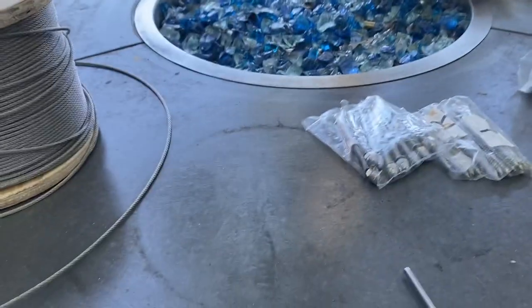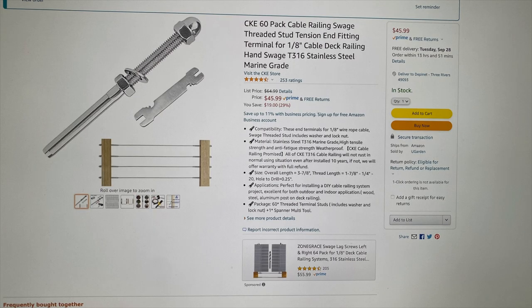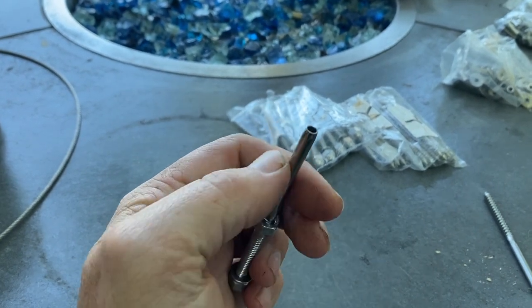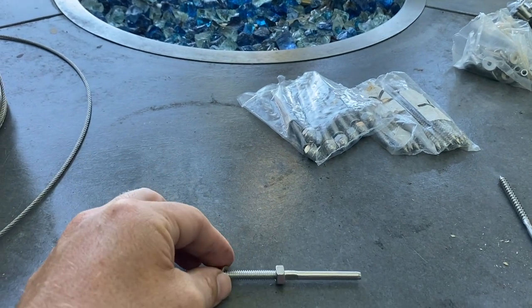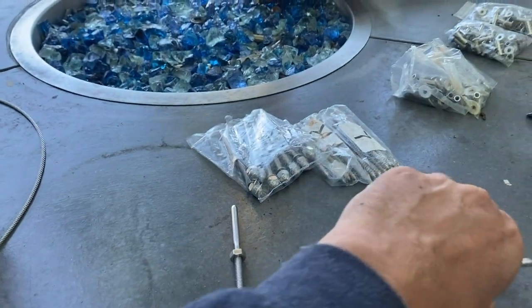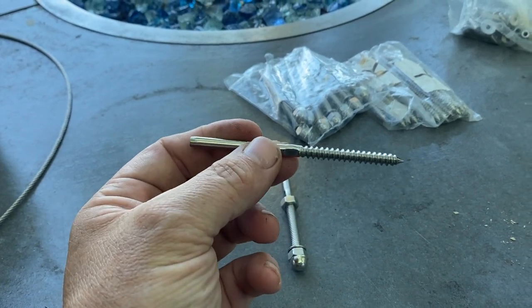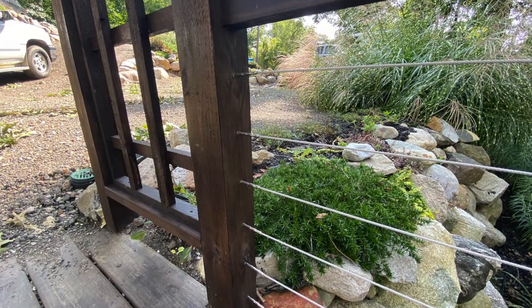The next piece is how you're going to tension the cable. All that is, is with this little device here. You drill the hole in your post, this piece is inserted through and crimped — the aircraft cable crimps onto here. Then you simply tighten down the nuts to draw the cable tight. This is the drill-through version. They also have a lag version if you're not able to bolt through — it's the exact same thing, it just screws in.